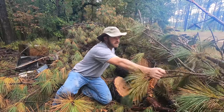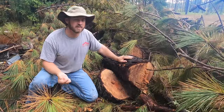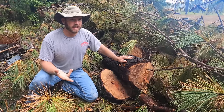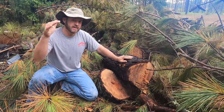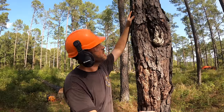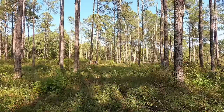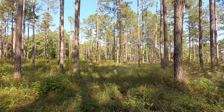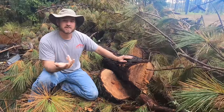Get this limb out of the way so that y'all can see this a little bit better. This is kind of a by popular demand video on the last one. I think it was 2 videos ago when we cut down several trees and made 2x4s in that video. This log right here was a waste log. It was a chunk of wood that had a cateye down towards the lower portion of the tree. And in the video, I said it kind of ruins the whole log having that cateye on it because it's this very dense area of pine sap where there may have been an injury or some kind of a genetic defect that the tree healed itself from. And it's not a structurally sound spot.